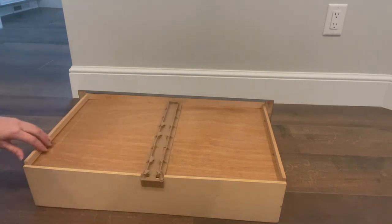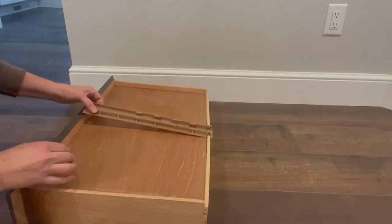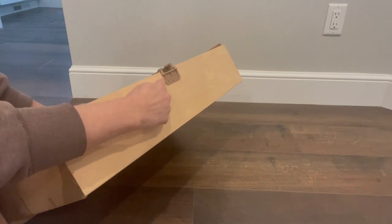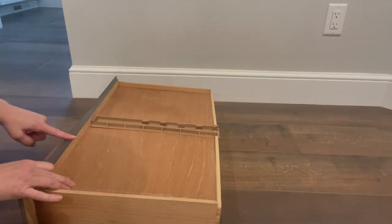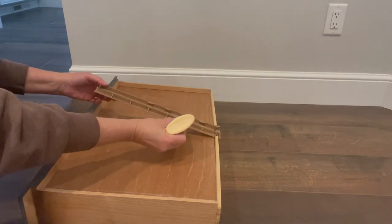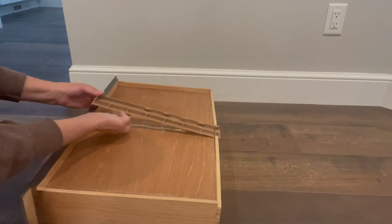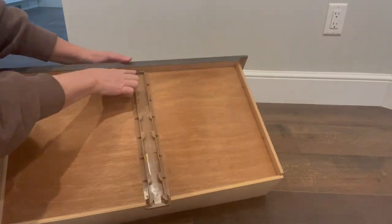And then this drawer was giving me a little bit more trouble. You can see the end of the drawer is actually kind of bowed for some reason. And the plastic glide, you'll see here in a minute, actually has a little round knob that sits inside the front of the drawer. And since this one was bowed, there was a gap in the front of the drawer, and so it kind of just kept bouncing every time you would open and shut it. So first things first, I just need to glue it down to keep it in place. And then I'll put some glue inside that little hole. You'll see it in a minute. And then clamp it overnight and see if we can reshape this drawer and have it fit snugly in place again.